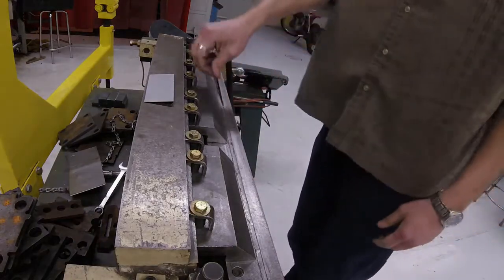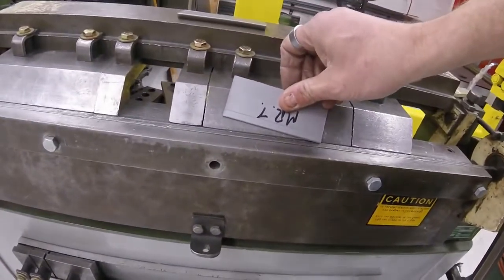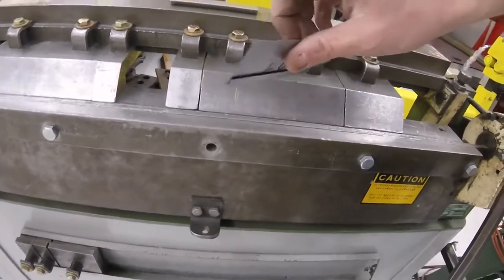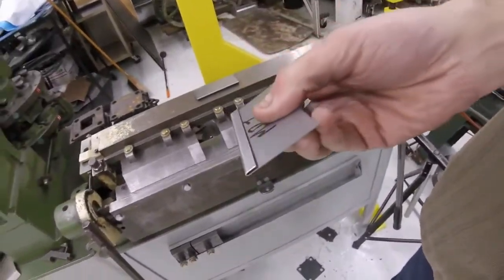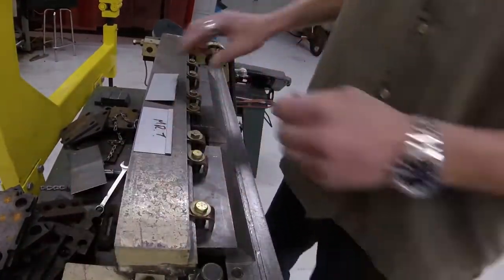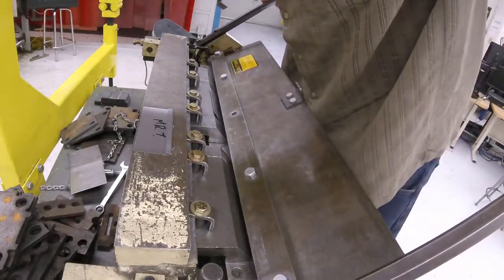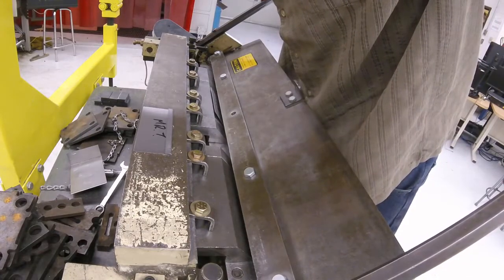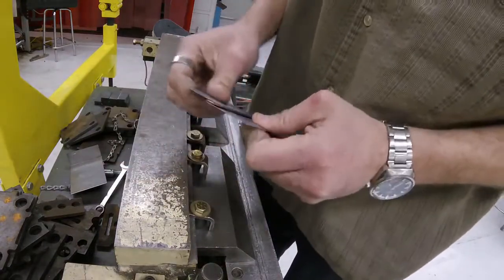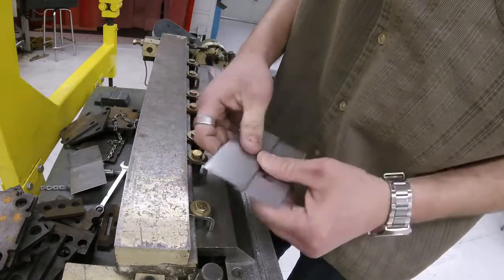If it tips up when you start bending, sometimes one side will push all the way closed and the other side won't close as much. We're doing this twice — once on each piece. We want it fairly close but not all the way crushed. Now with both pieces done, if we hook them together it's not too bad. We're ready to make some noise at the stake table.